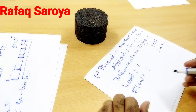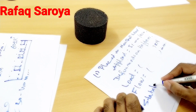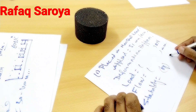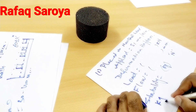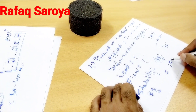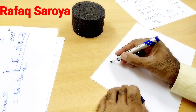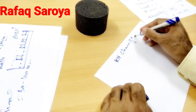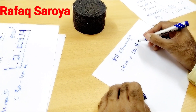Our stability, as per our specification, sometimes needs to be converted into kg or into newton. For my specification, it should be in kg, and its value is mentioned in the technical data sheet — it should be 1100 kg. To convert from kN: 1 kN is equal to 101.97 kg, so the answer will be converted into kg accordingly.